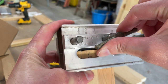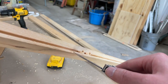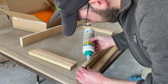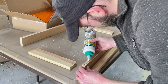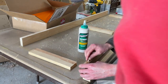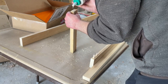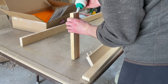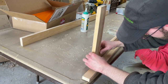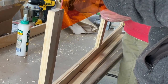On top of the tool, which you tighten down like a vise, there's a little hole where you put your drill bit through. You will get some sawdust — I just cleaned it out with a knife. Then you put some glue in to give adhesive for the dowel pins to cling onto. We put glue on both sides and started assembling, leaving the top off so I could paint before securing the acrylic panel, though I did put the acrylic in to test it first.